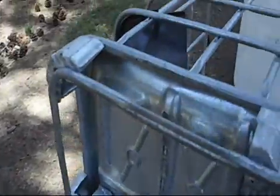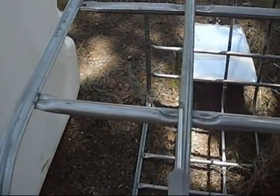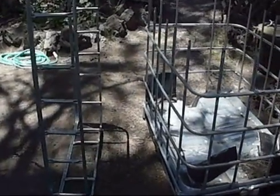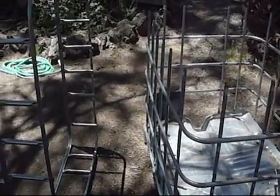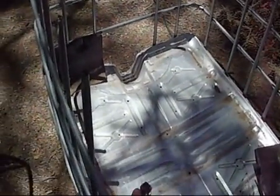Then the next thing - get your grinder and we're going to grind right here, and that's where we have this nice cage segment for the top grow bed. I got that cut, took me about 10 minutes. That's probably the most dangerous step where you want to use protective equipment - ear protection, eye protection - watch how you're grinding and cutting with that grinder.